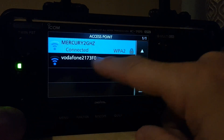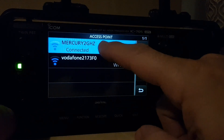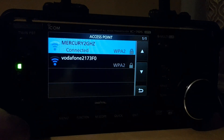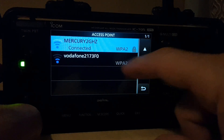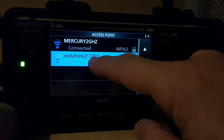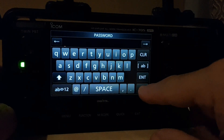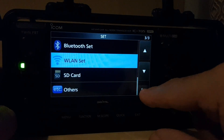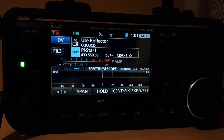Or we could go back one and go to Access Point — tap that — and it's going to find my broadband router here at home. We tap it, just like you would in the normal way, and it will connect. It already remembers the password from last time, but otherwise it asks you. So I put my password in, hit connect, and it connects to my network. That's how to connect your wireless LAN in station mode to your broadband router on the ICOM IC705.